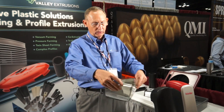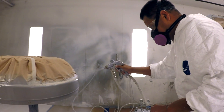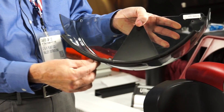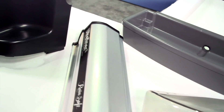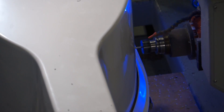This is a top for a lab machine — it's a carousel. We've formed smoke-colored polycarbonate over a male mold. The inside is the mold surface, and we've masked and painted a specific area on it. Then we extruded a profile at one of our other plants and added it to the bottom. We have full engineering teams at all of our facilities to take your design and make it manufacturable, providing 50 years of knowledge to help get your project to market faster than most other processes and companies.